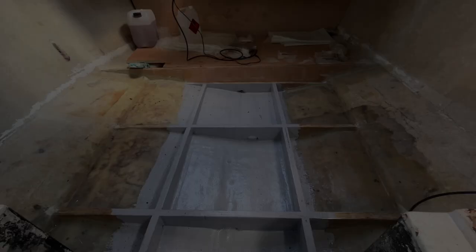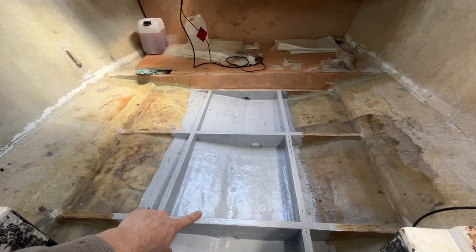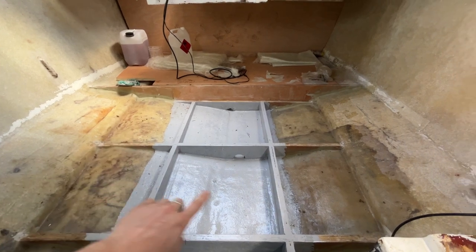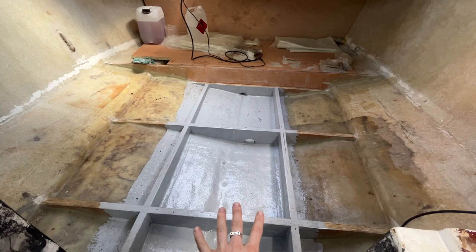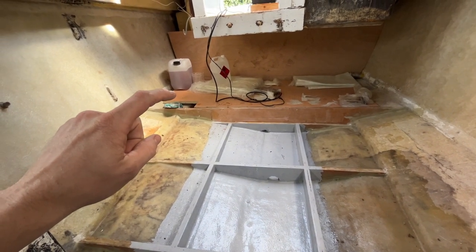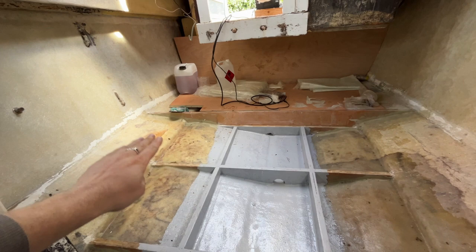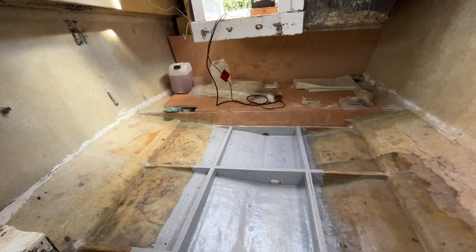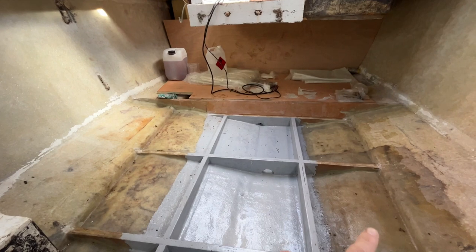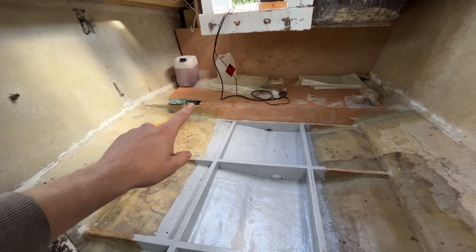Back in the boat now. What I've decided to do is paint at the end of each day so I'm not walking around and can carry on doing stuff. I've just painted the floor, so I'll wait for the floor to be done and then start on the toilet and butt it up. What I'm thinking now is doing the middle rib for the bed and the two stringers either side - that will finish the floor of the double bed. Then I just need to fiberglass it in, which I'll probably do all in one go with the toilet.